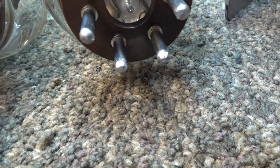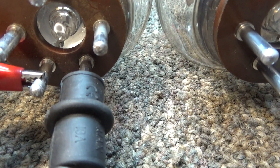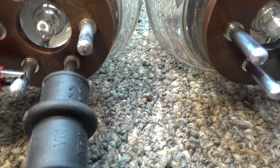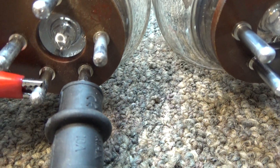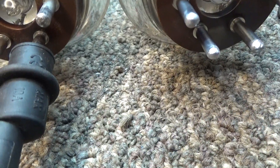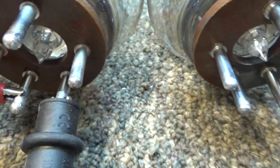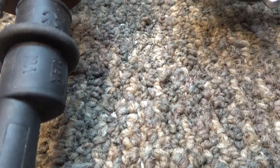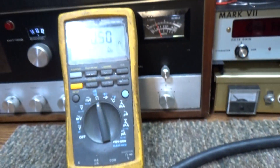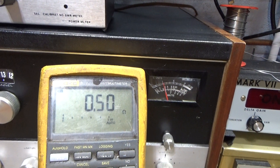Like I said a little earlier, the solder gets overheated and doesn't get a good connection. If you have filament problems, you always want to re-solder the filament pins. What I do is get a solder sucker, suck out the old solder, and then insert some new solder - it makes a better connection. One way of testing the filament is to connect across those two close-together pins at the bottom - remember the three top are grounds. When you connect across the filament pins it should read the same as a dead short, same as when you connect the leads of your meter together. I've got it connected here with alligator clips and you can see the meter reading 0.5, which is what it reads when I connect the meter leads together - dead short.